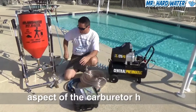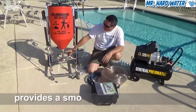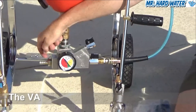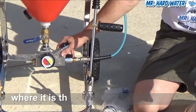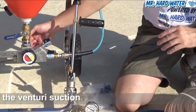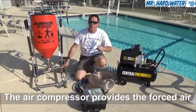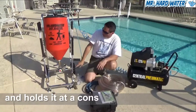The most important thing to note on this system is the Venturi assisted carburetor at the bottom. The media flows through this three-quarter inch brass valve and can flow in or out depending on how you control the valve. Once the media goes through the valve, it enters the Venturi assisted carburetor, and from there the media is delivered to the hose. The carbureted hopper is supplied forced air from an air compressor, fed into our regulator assembly through this blue hose.